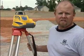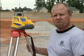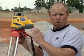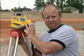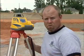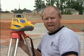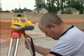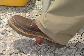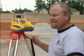Here we are out on the work site getting ready to use our laser level to shoot elevations. A couple of pointers before we get ready: make sure that this is in fact screwed down tightly to the tripod. This is an expensive tool and you don't want it to fall down. Also, make sure and use the little arms on the legs to make sure that they're securely fastened into the sub-base so you have a stable base.